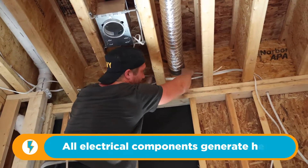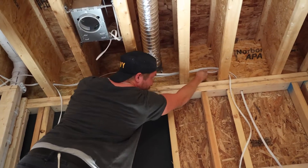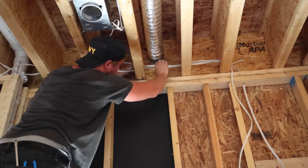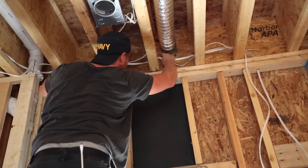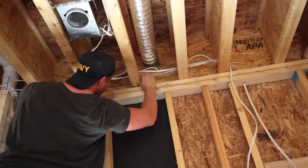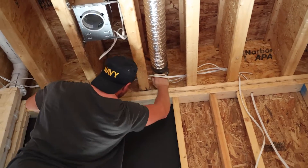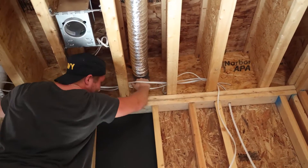The jackets were melted off the wires, copper shorted to copper, arcing, sparking, and houses did burn down across America as a result of that improper technique. So as a basic rule — the thought processes and mathematical calculations are more advanced further down the road — but as a basic rule, do not bundle more than three home run cables together in a hole with a zip tie or any other kind of securements.